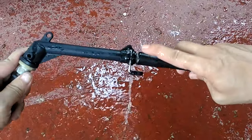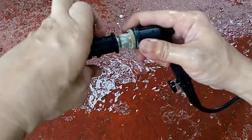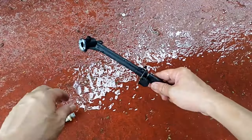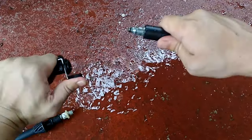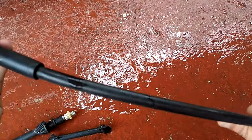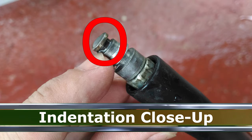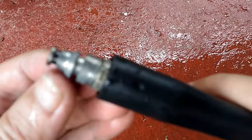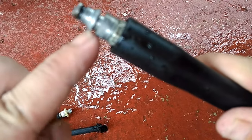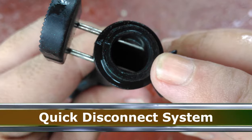And will you look at that? The leak is actually coming from the spot between the hose and the stem, and nowhere near the barrel. If we look at the tip of the hose more closely, it has an indentation where an O-ring is missing. Actually, I found the O-ring off camera, but only half of it — the other half must have disintegrated a long time ago. No wonder the leak was that bad. And the larger indentation farther down does not need an O-ring — it's actually the locking mechanism that joins the hose to the handle's inner stem.